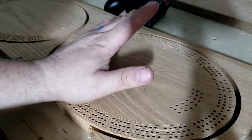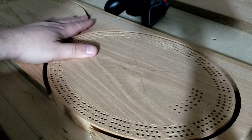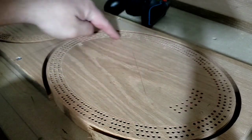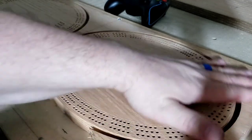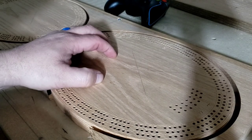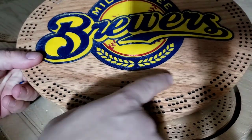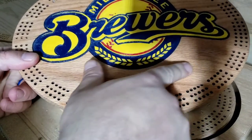where I will sand them down, get them cleaned up. I will put probably two coats of shellac just on the front face here because I'm going to paint these lines black after they're sanded and the letters black. And then I'm going to sand it down and the shellac and the paint will all come off and it won't soak into the pores of the wood. So then you get that nice quality look still when you oil it. All I use is butcher block oil and the conditioner. I don't use a poly coat.